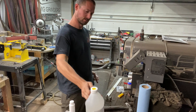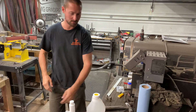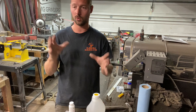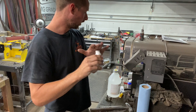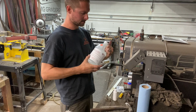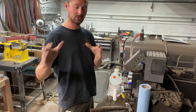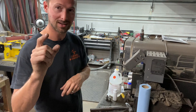We're back. We've got our new Cactus Juice ready to go, and I've spoken with a ton of people about antlers. Hopefully I can explain a little bit about what I've learned over the last week. We are going to stabilize these antlers. I've got my Cactus Juice resin ready to go - it comes with a little activator. I think this stuff's only good for about six months after you buy it, and it's actually very expensive - about $70 to $80 for this jug. I've got my pump here and we're going to get this stabilized. I'm also going to explain a very important step that I've learned recently that I think will result in a really good handle.